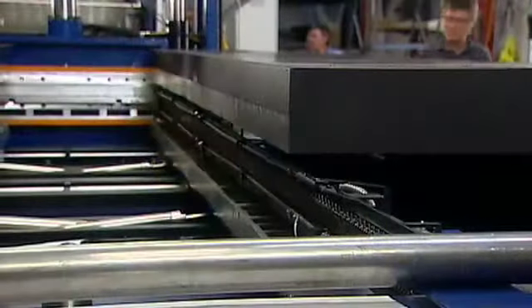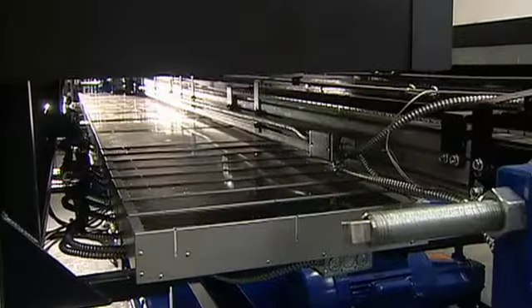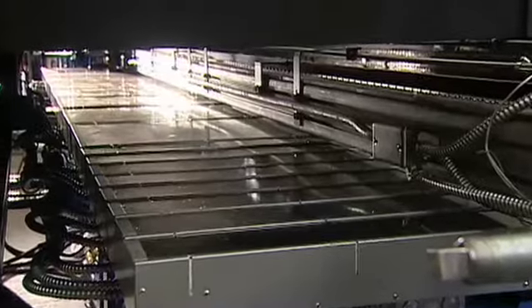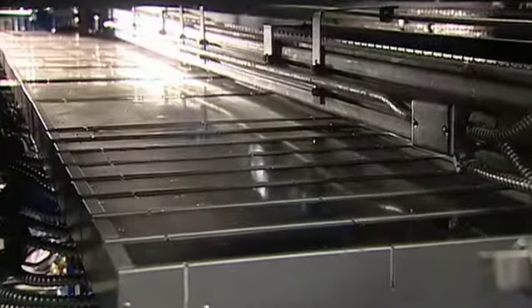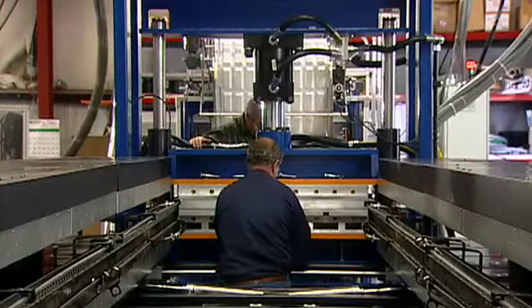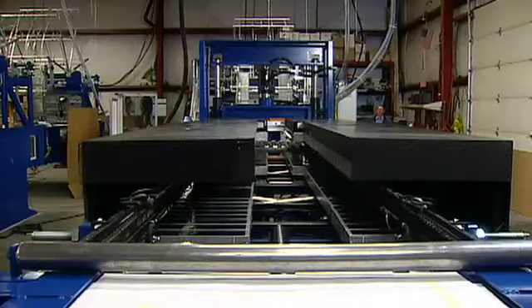We designed the oven on the SX44 to be friendly to the operator and efficient to run. The oven moves back and forth to accommodate different mold sizes. We have heaters in the back end of the oven where the foam enters that you can turn on and off, so the technician has maximum flexibility in setting up different processes. The oven opens in the center in a clamshell outwards, so that in an emergency stop situation the ovens will open up and not melt the sheet or have it drip into the oven. It just makes it easier for the operator or technician to get the machine up and running.